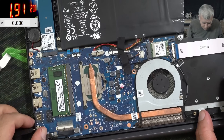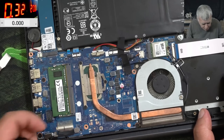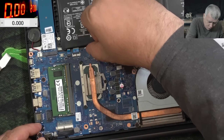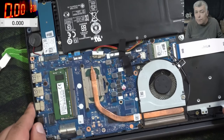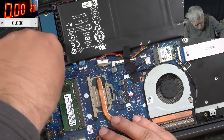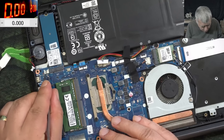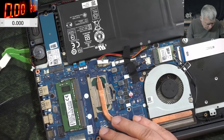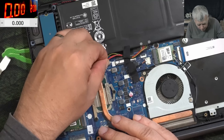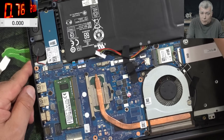So what can be wrong here? We have a switch there — check that. What happens if we press this? Actually, let's disconnect the battery. I've seen laptops that have a BIOS reset button but they didn't get reset, so I have to unplug the battery. Let's unplug the BIOS battery. Short the BIOS battery. Plugging back the BIOS battery. Plugging back the main battery — actually no, we don't need the main battery, because we want to see. And the laptop is coming on.